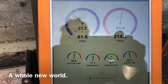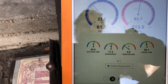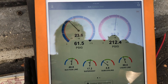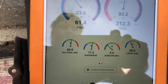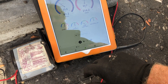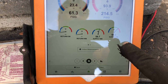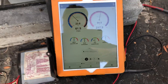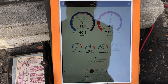It doesn't seem like there's lag either — we can test that on a pump-down test in a minute. But my compressor superheat is a bit low, I'm going to have to fix that. And it does look like the TXV's flooding a little bit, so I'll probably push that down. Sub-cooling on these little condensing units — they don't have a whole lot of sub-cooling, so when you see like 5.4 there, that's normal for these; they're pretty inefficient. I'm going to take this probe — fingers dirty — alright, here's my ambient right now: 67 degrees. 68 degree ambient. I'll take this in the box and we'll use that for our box temperature. Remember, this app is for air conditioning, it's not a refrigeration app per se, but we can use it for refrigeration. I'm just stoked, everything's just working really good right now.